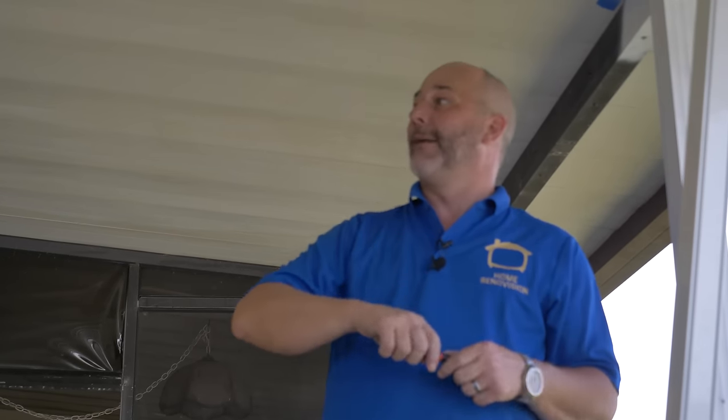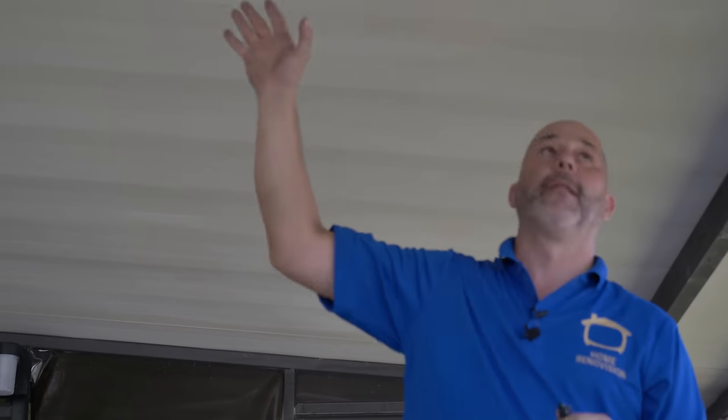Nothing is square, okay? It's impossible to know. But you do have a roof that has ceiling panels and they have lines. If you build your wall in line with a ceiling panel, which is about as close to square as you're gonna find around here, then at least visually, there's nothing else in this space to tell you if you're square or not. So having that line up is gonna be paramount. So what we're gonna do is drop a laser line.